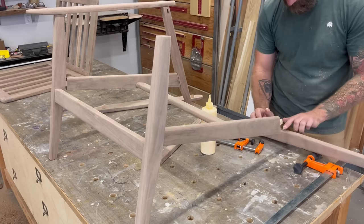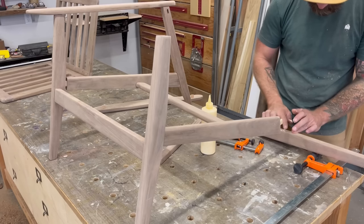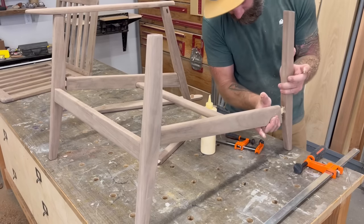I did this by going over to my oscillating belt sander and just eyeballing it by hand, tapering that front down until it got to a point that looked nice. After doing one I tried to match the other as close as I could — keeping in mind they're separated by the width of the chair, so you're never really going to be able to compare one right next to the other. As you can see in this side profile, that nice little taper up toward the front just gives it a little extra shape and makes it look that much softer and cleaner.